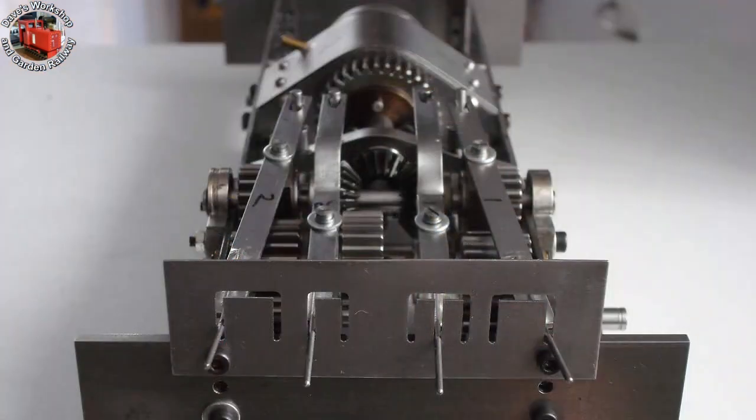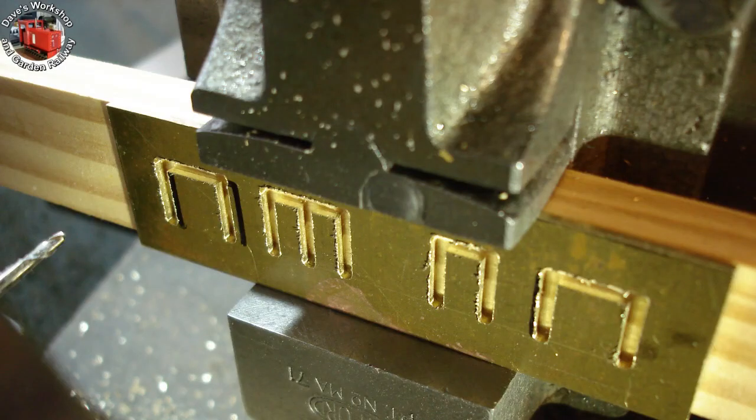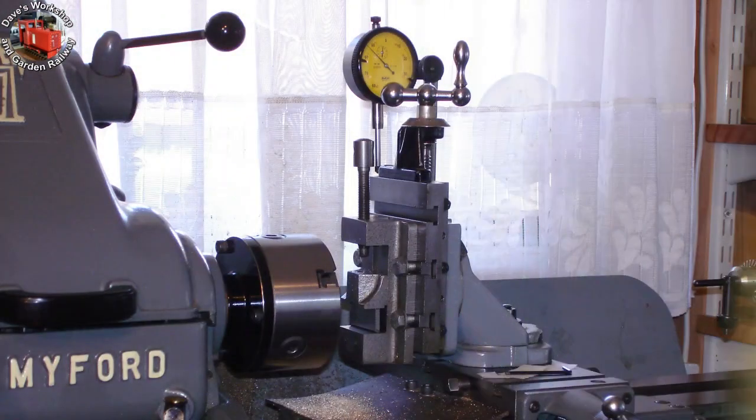Back in 2014, when I built the loco, I made a gear selector plate. I decided to use this as a template to cut another from 1.2mm brass to bolt to the back sheet of the loco, as gear changing has been difficult within the cab. Quite faithfully copying the dimensions, but with a 2mm carbide slot drill belting along at top speed, full depth cutting all the way. Here's the milling setup, using the 1 inch plunger clock as a poor man's DRO.